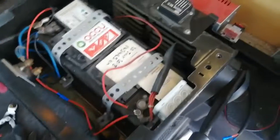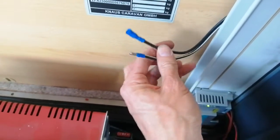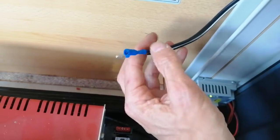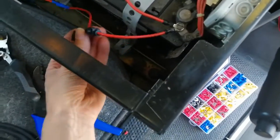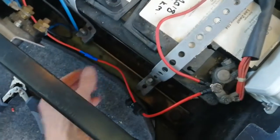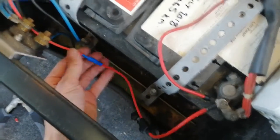Little update on how we're getting on. This is the wire from the cigarette lighter unit running into the living room. I've put crimp connectors on there — male on the positive, female on the negative. On the battery I added the inline fuse holder; the fuse isn't in there yet so it's all safe. Crimped this to the solar controller, so that's the inline fuse holder then crimped.